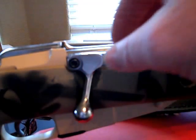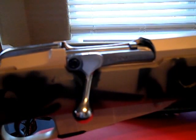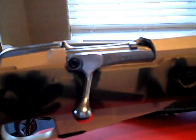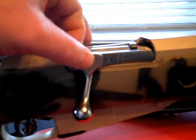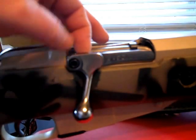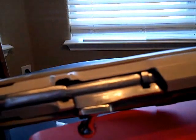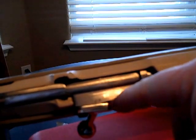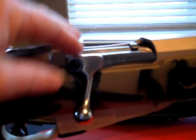Cut the bolt off. You're going to have to put it up there, and then just start filing. I took a file, put my bolt in a vise, and started filing, and then testing the depth, and then filing, and then testing the depth. It took me probably 20 or 30 minutes of filing and testing before I felt comfortable where it was. I probably could have gone a little bit more, and maybe got a little bit better seating here, but like I said, I don't know if you can see it on the film, the Mosin Nagant bolt is rounded everywhere. So it's touching here, but it's touching in the center, so it leaves a gap at the top. So at some point, you're just going to have to accept the fact on this.